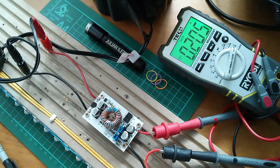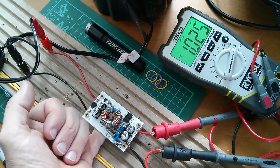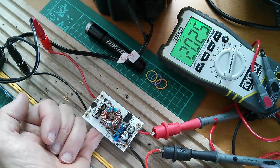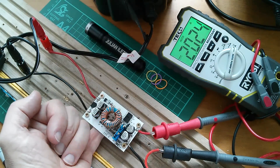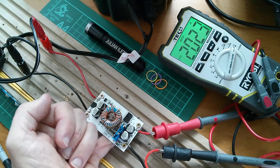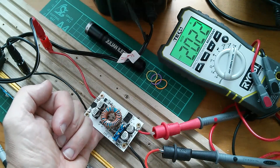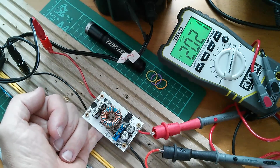So I think we're all set now. At one amp I'm not feeling any heat under there, so let's go to two amps. At two amps that's starting to feel warm, particularly directly beneath the MOSFET, which is just at that point underneath the inductor. The MOSFET is starting to get much warmer now. Let me just check the temperature of the heatsink that the LED is on, because I haven't actually got my fan running yet. I suppose I should do that.